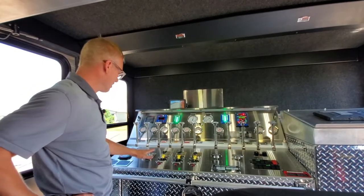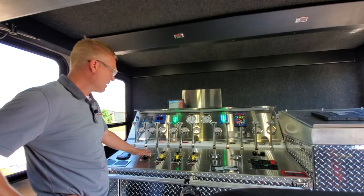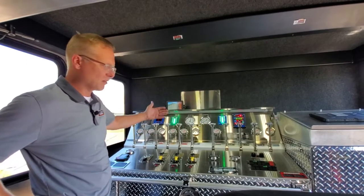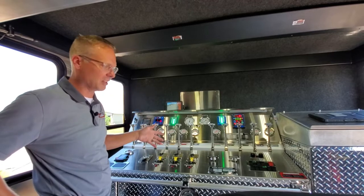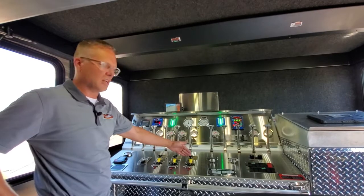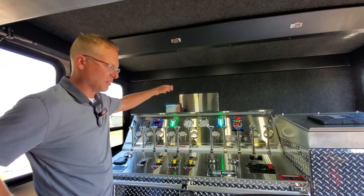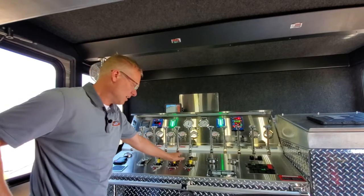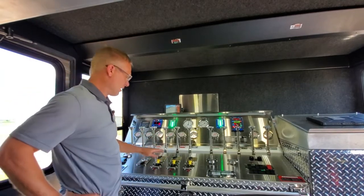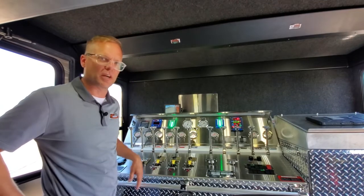Across the lower section, we have a master discharge on the officer side, the Trident auto air primer, and pre-primers on the side and rear intakes. The scenario being that you roll up on scene — granted they've got a 1,600-gallon tank on this truck, but eventually you run out. You want to transition over to a folding tank. You can pre-prime through any of these intakes, and you could have three folding tanks around this truck if you have the space. You can pre-prime that intake and it'll hold the water there until you're ready to transition from your onboard booster tank to your rear intake — getting that done in basically about 15 to 20 seconds to prime that rear intake line.